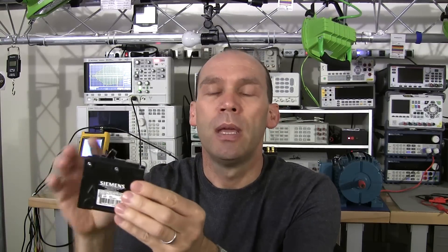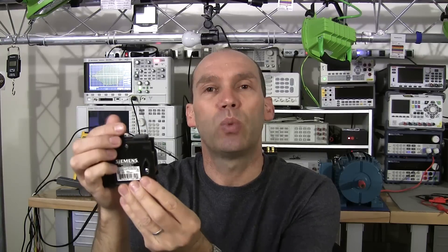Your general circuit breaker that you might have in your breaker box or DB board serves several functions — there are probably four key functions. With a breaker like this you can see it has a switch on the front which can switch a circuit on and off. It'll have a rating — this one happens to be a 20 amp breaker, and that's 20 amp RMS, which is going to be important. So it can make or break a circuit; it acts as a switch. It can also act as overload protection — if you've got it rated for 20 amps and your circuit starts drawing 22 or 23 amps, it can trip to protect the equipment and wiring.